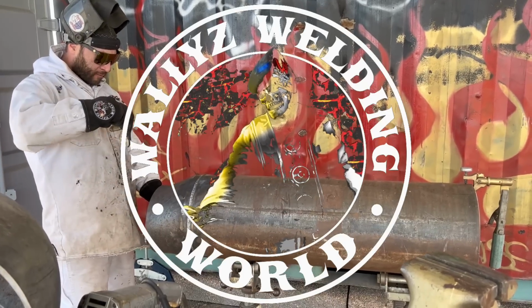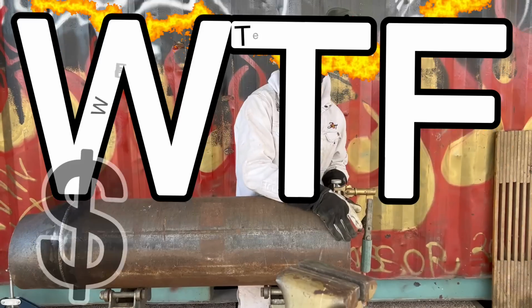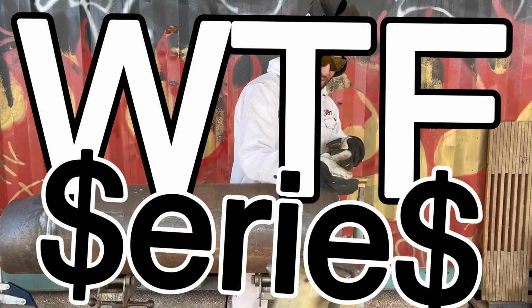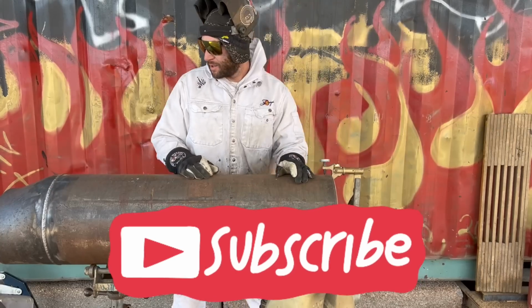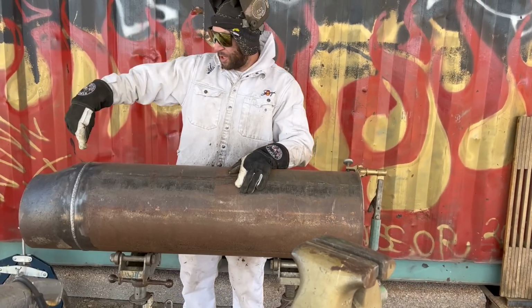Now that I have welded this piece out, I'm going to go ahead and make my next roll out, which is actually a 90 that I transition on this side of the pipe. And the 90 will come out this way and go that way. So what I'll do is I'll go ahead and probably put this 90 on its side, and then I'll probably roll it up or square it somehow on the side with this in position of the way it needs to go. Okay, and then after I do that, we'll go ahead and show you how to counterweight it and make a roll out